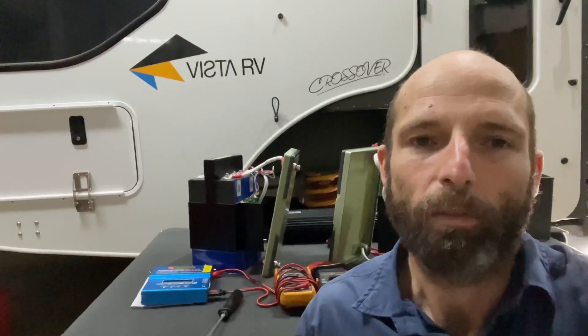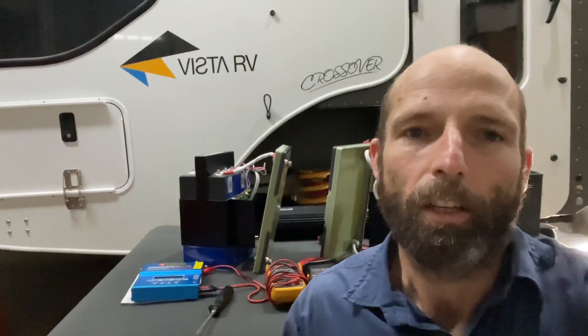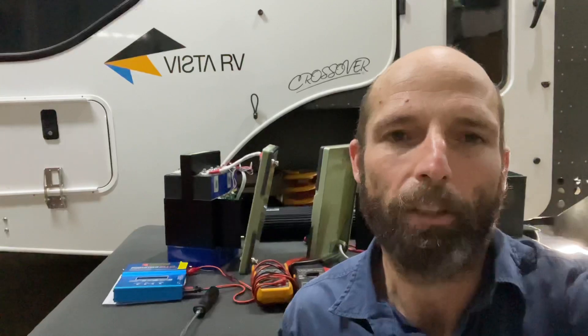So when you're looking for a battery, don't worry about the amp hour capacity because you're never going to use 100 amp hours in a night or two nights, really. You're looking for a battery that will actually work well as a storage device — that's how well the cells stay balanced over the life of the battery. That is the biggest failure point I've seen with lithium batteries: cell imbalance. What you look for when buying is a good quality BMS — something that'll have 100 amp discharge capacity for a 100 amp hour battery, and also active cell balancing.